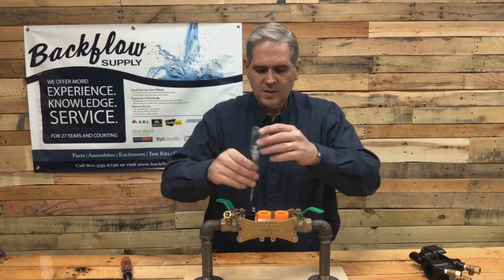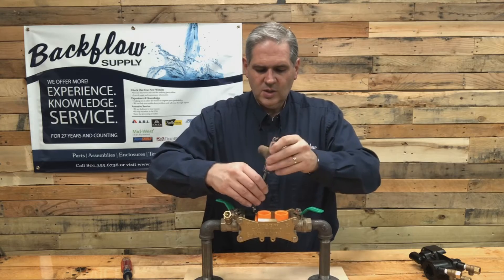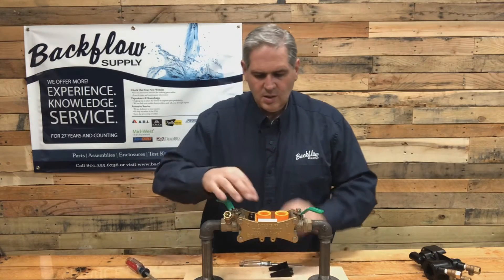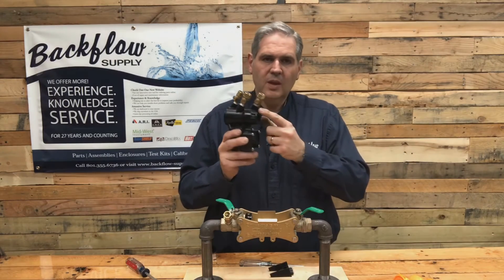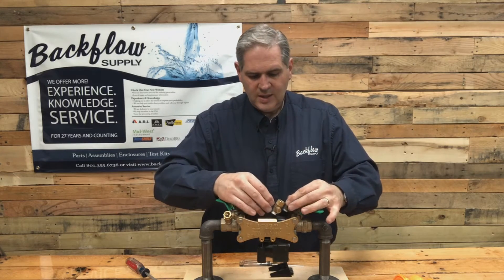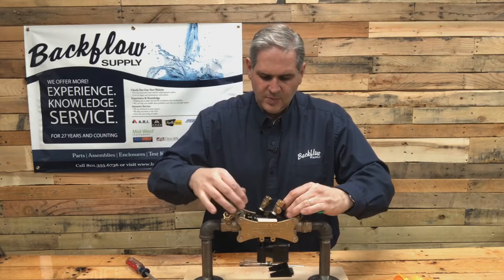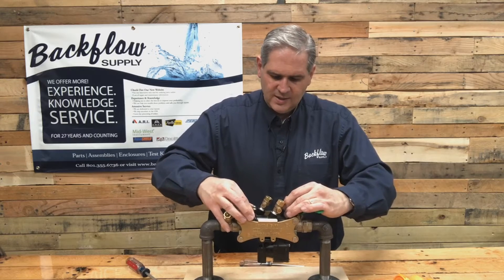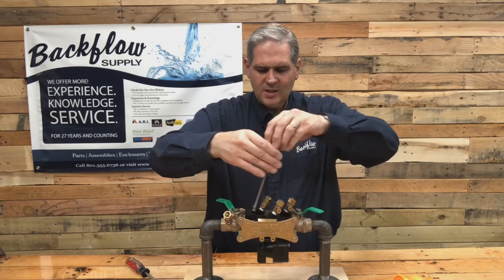Now I'm going to show you how you put the vessel back in for the spring. You'll just undo these two screws again, lift up the wedge, and slide the blowout fitting to the inlet side and up and out. Get your vessel, make sure that the o-rings are still there, and put a little bit of lube on both o-rings. Then nestle the outlet side of the vessel on that lip, take your wedge, and slide it over to the inlet side — wiggle things around and make sure everything's lined up.